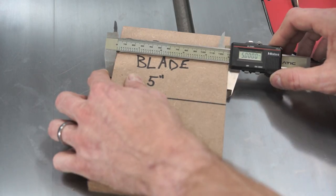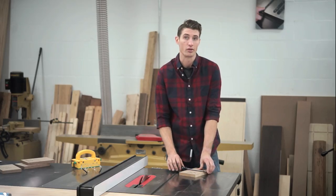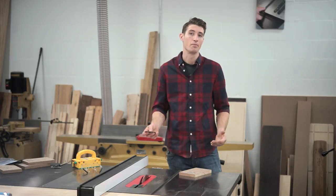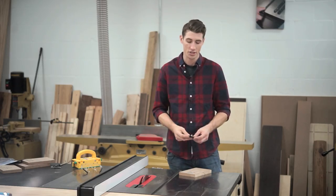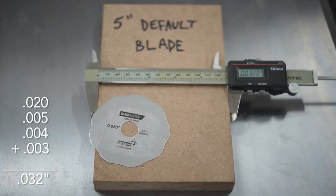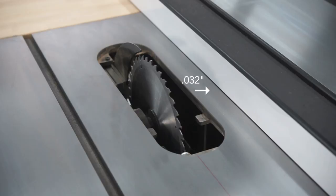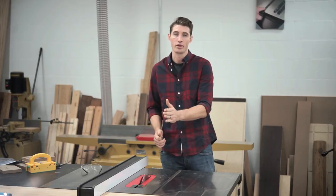Since we're dealing with thousandths of inches, we're going to use a digital caliper to measure the difference. After you verify with the caliper that the top half of your board is exactly five inches, zero it out. Now measure the bottom half that we cut with the thin kerf blade — the number you see on your caliper reading represents the difference we need to make up in arbor shims. This happens to be 32 thousandths of an inch, so we need to combine shims to get the appropriate thickness. The set comes with six arbor shims: the thickest is 20 thousandths of an inch, then 10, six, five, four, and three thousandths of an inch. To correct the difference, we need to use the arbor shims as a spacer between the arbor flange and the thin kerf blade, moving it out 32 thousandths of an inch toward the fence. So we can remove our blade, install the shims, and cut it again, and we'll see that the zero cut line matches our default blade.